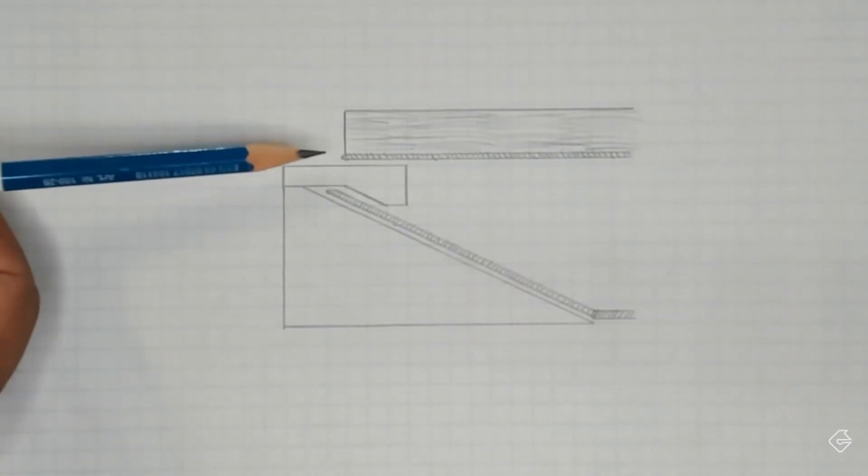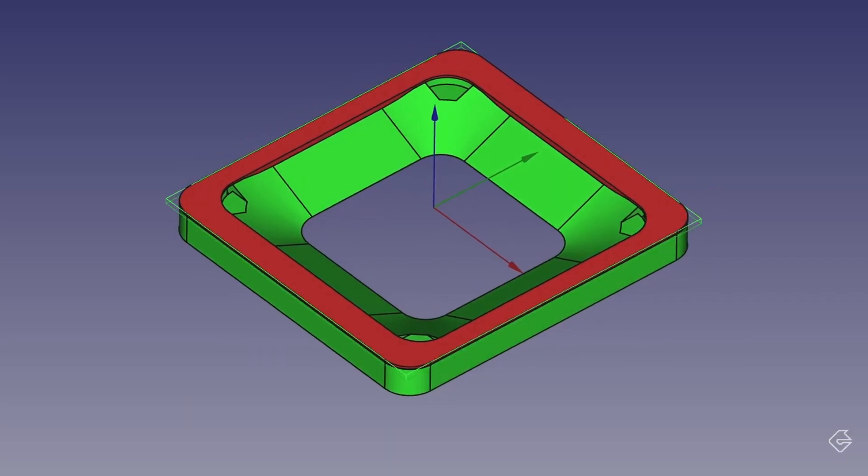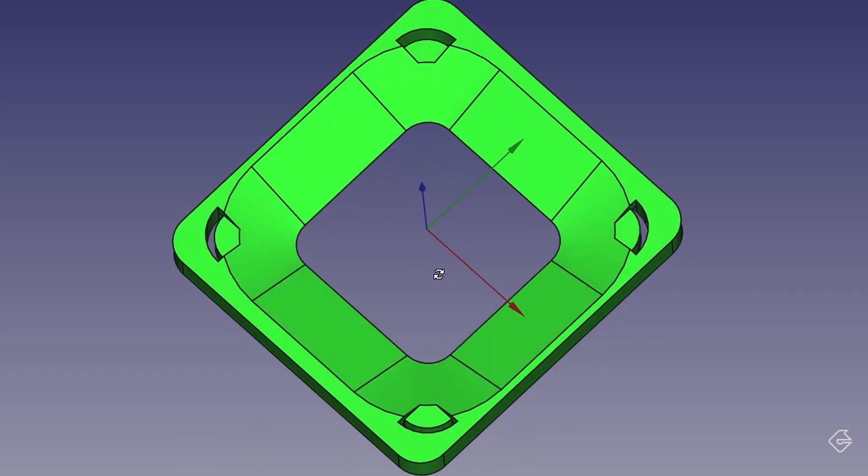The diffusion film is fairly floppy, so we need something to hold it in place. This is a clear acrylic panel, and it works wonderfully. If I take our diffusion film and put it behind the clear acrylic panel, I now have a nice solid surface on top. In our drawing, you can see the diffusion film sitting down here and the acrylic sitting on top. Now let's talk about routing the wires coming off the LED chip. The anode and cathode leads will come off the PCB and go back behind the reflector through two of these corners. There are four holes — we're only ever going to use two at a time, but for symmetry I put four in there.